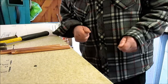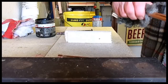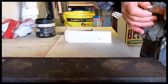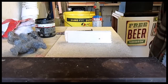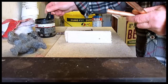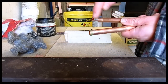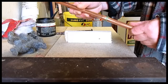Now we're going to solder that. We've got two pieces of wood here to put it across. Just going to clean the copper with a bit of wire wool — clean both parts. This is just to get any dirt off; copper tends to oxidise when you leave it. That's nice shiny copper that's not oxidised, but if you leave it somewhere it gets a little brown colour and it's better to get that off. So here's the flux — this is Laco flux. You only need to flux that bit because we'll put it into the socket and twist it, so now the flux is all the way around.